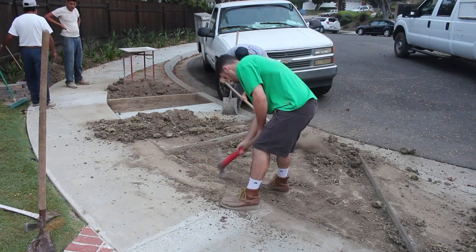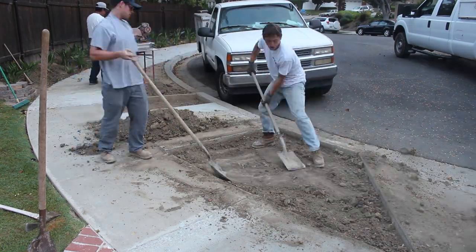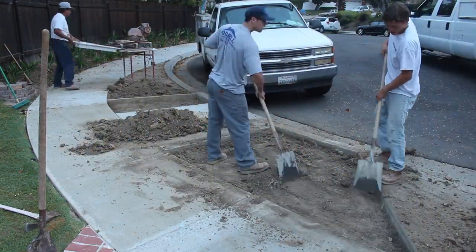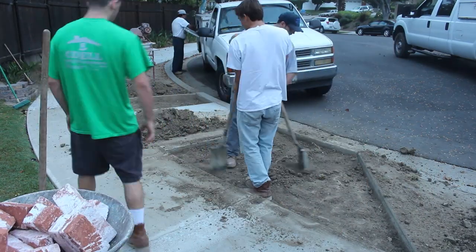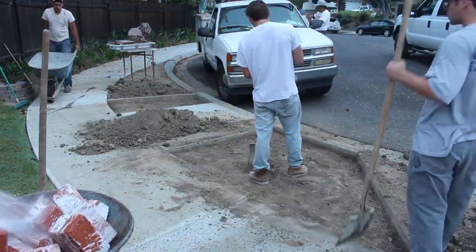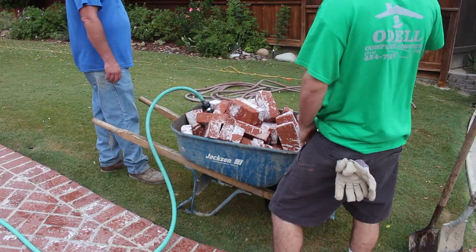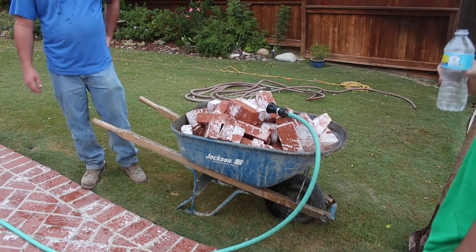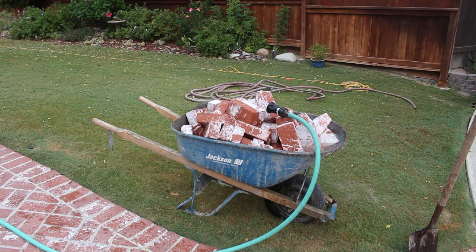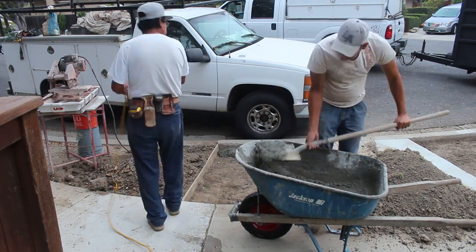The white flash manufactured used brick doesn't hold up very well with a lot of foot traffic. The white of it comes off and you end up with a red common brick in the long term. So high traffic areas I don't really recommend them, but they're great for other areas like maybe a planter bed or the face of a house — somewhere where that white coating isn't going to wear off.